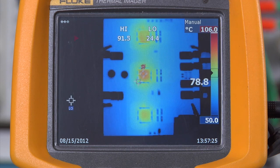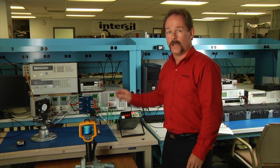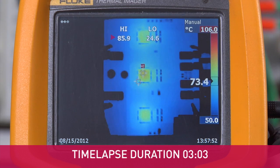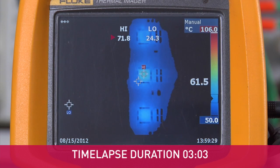Even at 110 amps, we are only running at 91 degrees C — still a very cool temperature given this power level with no air flow, no heat sinks. Now again, if you have a high operating environment, we will quantify the impact of a 200 LFM air flow with no heat sinks.